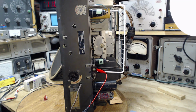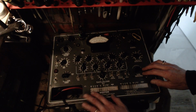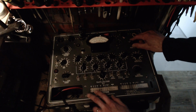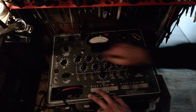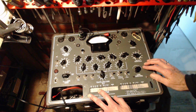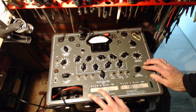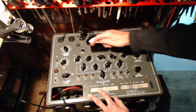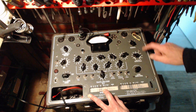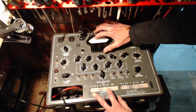Okay, tube testing. Okay, here we go. Oh, 6J7. Let's just double check here. 6J7, 6.3 volts, signal level. A 1, a 2, or a 3? 1. Then the settings: 17342, 0610, 40, D, 800. If we're happy at 800, happy there.